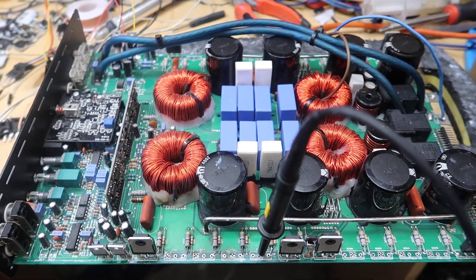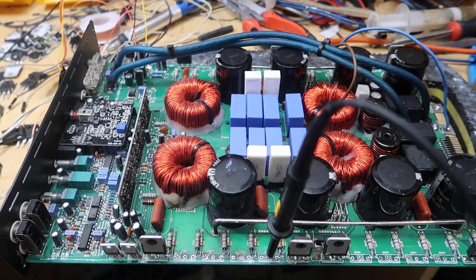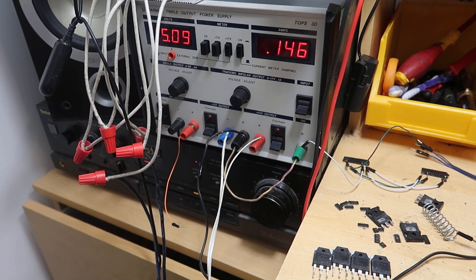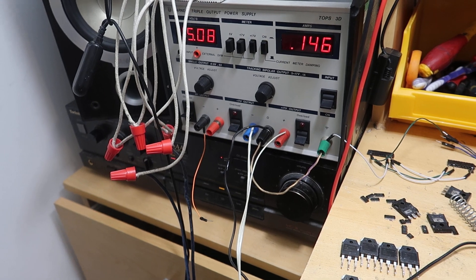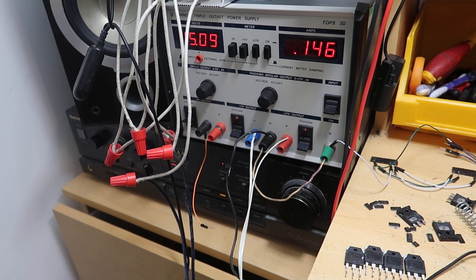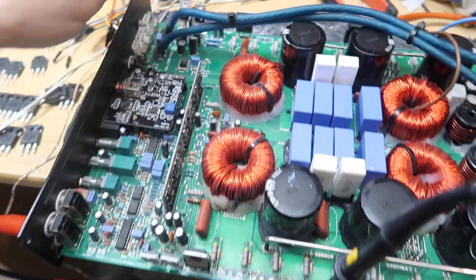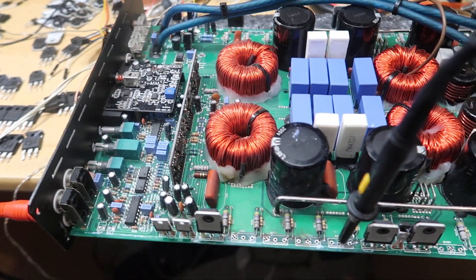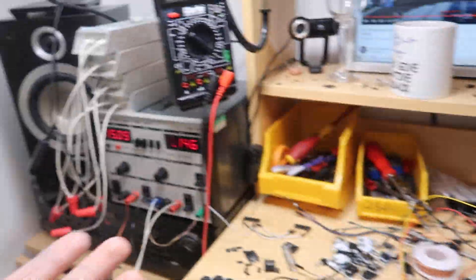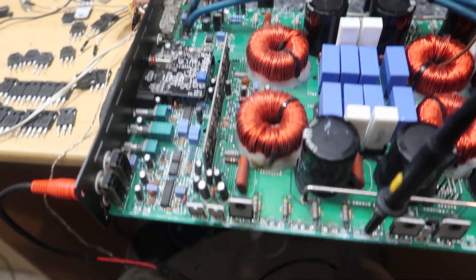I just thought this would be interesting to show you guys — I have no script at all. If you have any questions on how to get this set up, just let me know. All you need is a power supply that can generate plus minus — I think the absolute bare minimum is about 15 volts, because any less and the 12 volts above negative rail isn't going to work properly. Plus minus 17, 20, or 25 is going to be absolutely fine. Just keep an eye on the voltage regulators — in my case they're running really cool, barely warming up, because my voltages are so low. You can go a bit higher but if your rail voltages are too high, the voltage regulators just can't deal with dropping that much voltage down to where it needs to be.